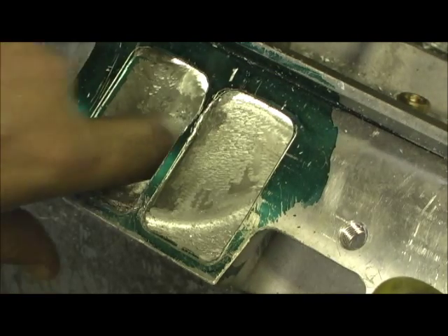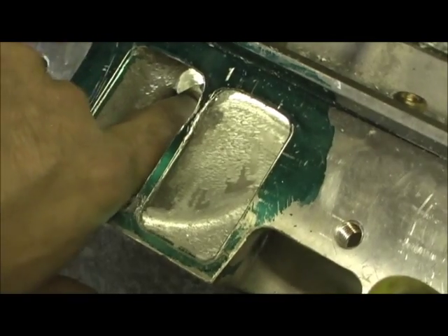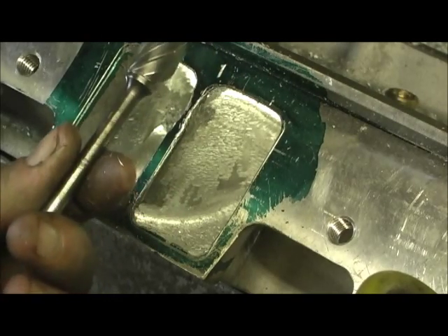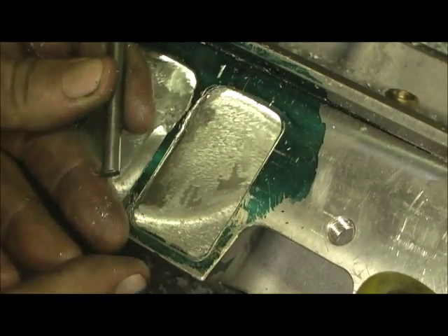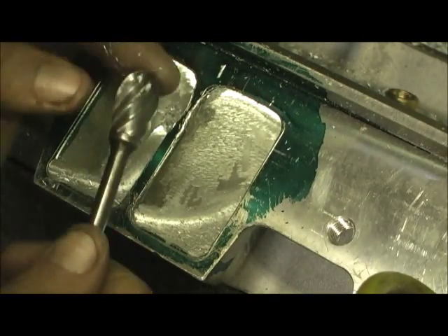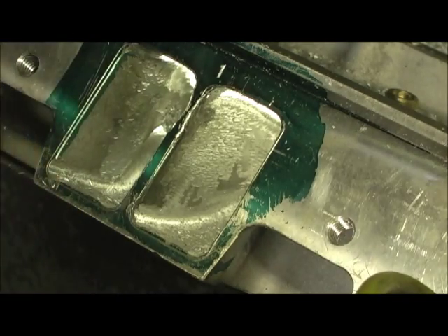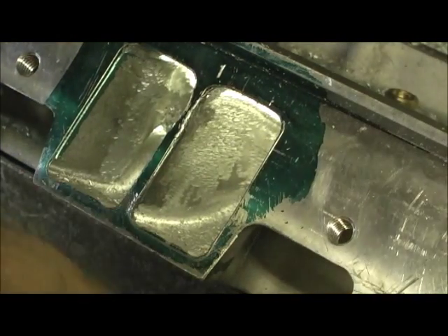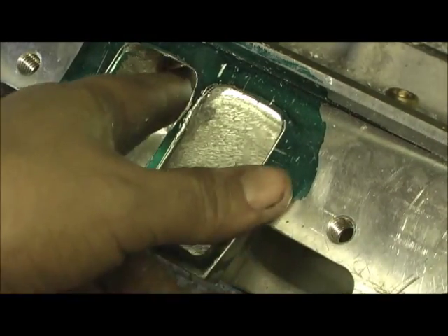By doing that, it's going to take some of that sharp elbow out and allow me to get in there with the bigger cutter. I'm going to get a big egg on just a little bit longer cutter, but the problem is when you get this big heavy weight swinging on there, it can get really hard to handle. The only die grinder that will do it is the one that I use — it's the only one that can remotely come close.